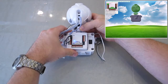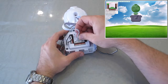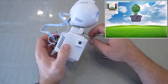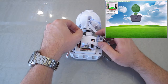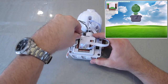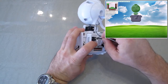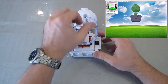Insert JD's head. Connect the camera cable. Connect the RGB LED eyes cable to the I2C port and verify operation. Connect the horizontal neck servo to port D0. Connect the vertical neck servo to port D1. Vertical moves up and down. Horizontal moves left and right.